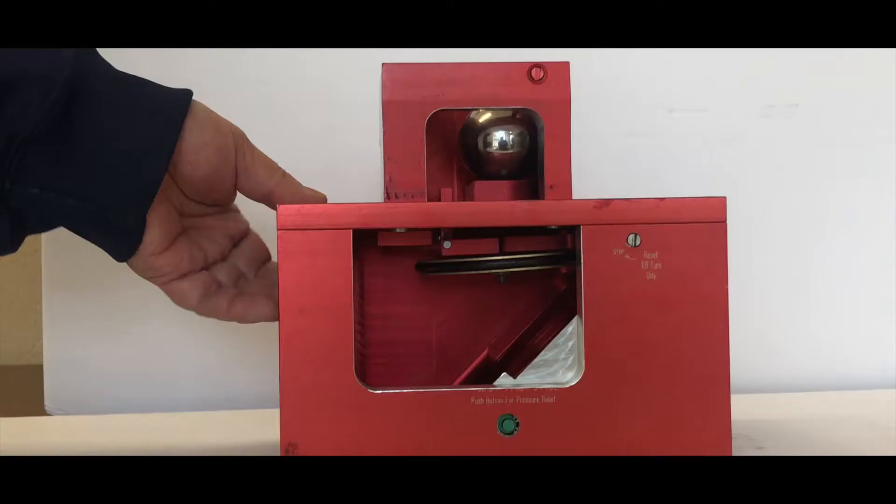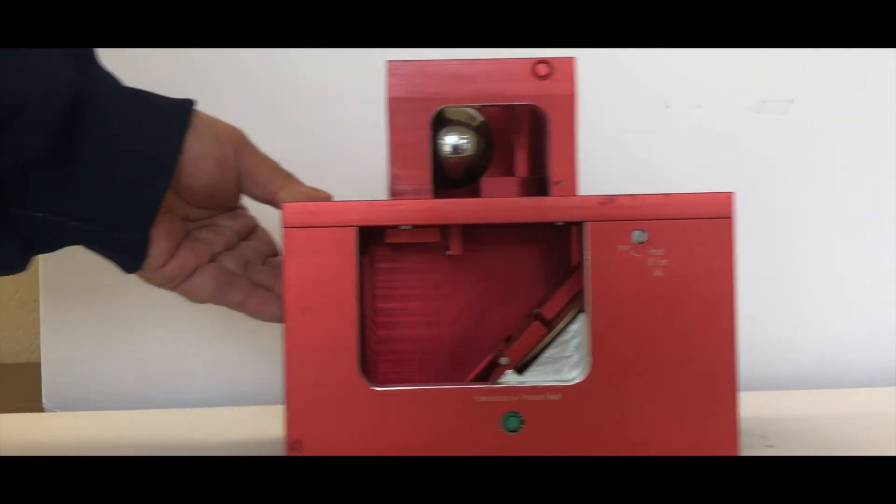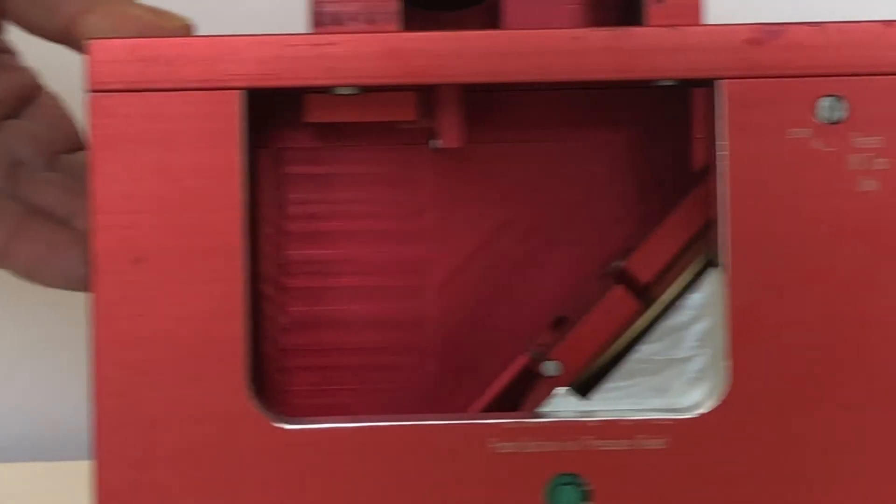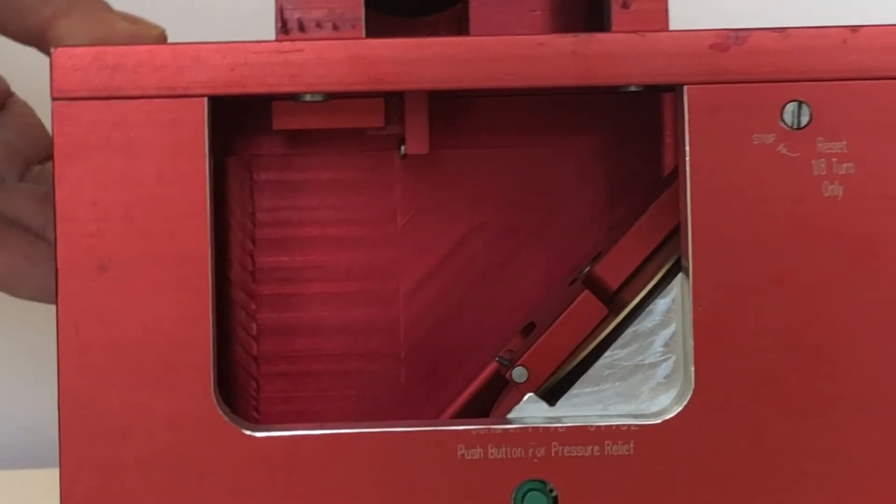The nature of the mechanism behind this product consists of a metal ball moving around on the inside between a ball seat and a trigger. When an earthquake shakes the valve, the ball falls out of the seat and onto a trigger, which pushes it down, unhooking a latch, causing the valve's flapper to close, shutting off the gas flow.